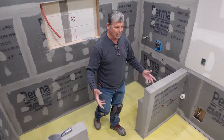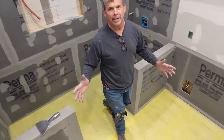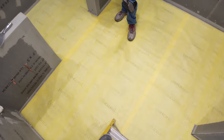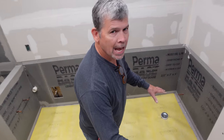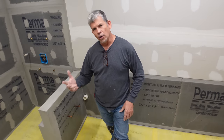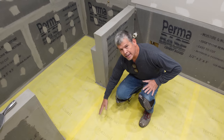What a difference just putting some color in this bathroom makes — can't wait to see what tile is going to look like. We always recommend you pre-cut your sheets. The last thing you want is for your thin set to be hardening in the bucket while you're cutting your last sheet. Get it all done ahead of time — all the math is done. All you have to do is spread thin set and smooth out your membrane into your thin set.